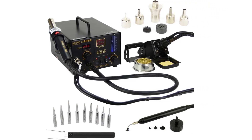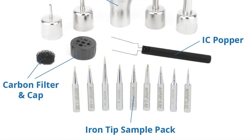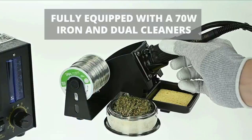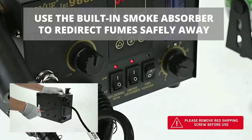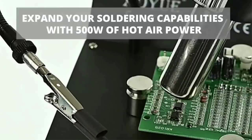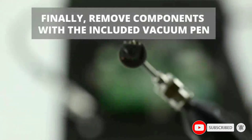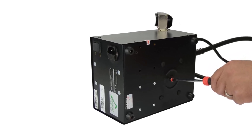A powered vacuum pickup tool is included and can be used to pick up small ICs. Advanced features include auto nozzle cooling after reworking, auto sleep function when placed in the hot air holder, digital display of hot air set and actual temperature, and a microprocessor-controlled self-testing hot air heating core system that warns the user when aging or breakdown of the heating core occurs. It also features digital calibration of the soldering iron, and a configurable stand that can be set up with the spool holder on either side, with an optional sponge holder. The stand fits any of the available irons.